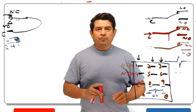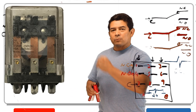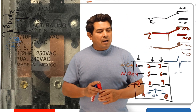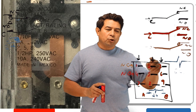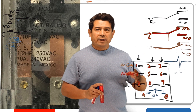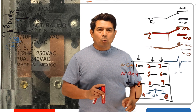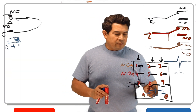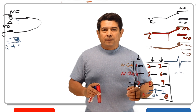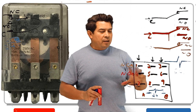So this is about your ice cube relay. The other thing I wanted to point out is that if you look at the relay, it has some writing on it. It's going to tell you how much amperage and how much voltage you can put through each one of these contacts. It's going to say at 110 volts you can put this many amps through here, or at 220 you can put this many. It's also going to tell you what the coil voltage is. It's very important, because if you put the wrong coil in there, one, you could burn it up, or two, it may just not energize. So this is the ice cube relay and this is basically how it works — these are the connections to them.